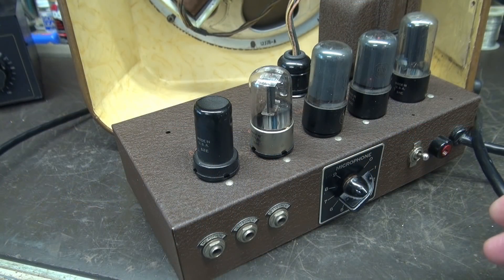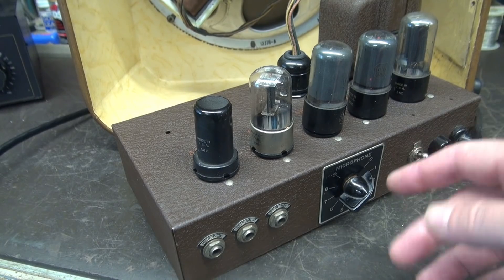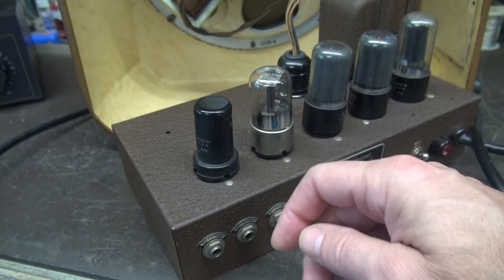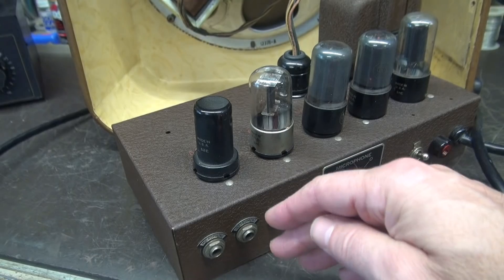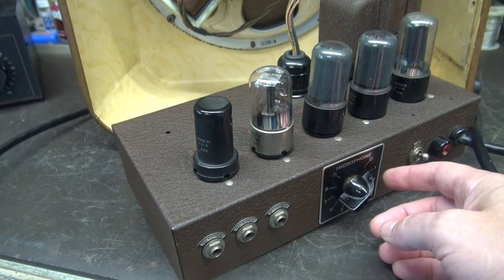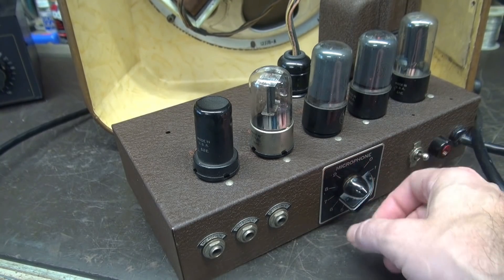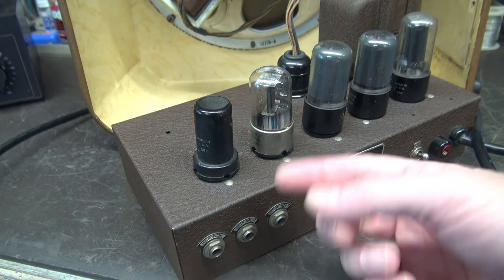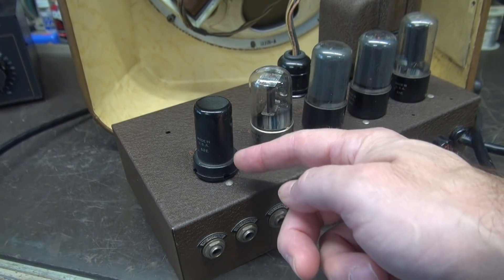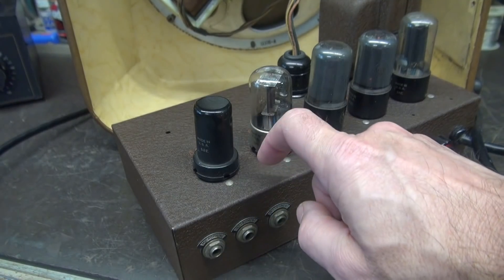Here's where we left off on the Gibson after I changed the filter caps in part one. I also identified that the ground tab on the input jack that should be shorting the signal out when you're not using the jack is bent. This jack is damaged. Right now we're idling, the amp is at zero volume, all the way down. You can hear we still have quite the noise level. I assumed that was a microphonic tube, but that may not be the case. It's very sensitive in this area.